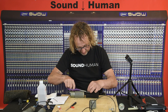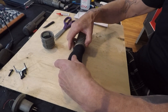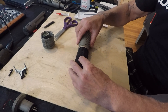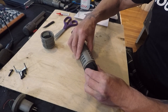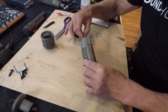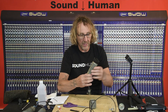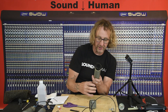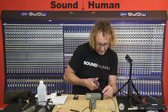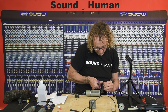We've added hot glue beads around the outside of that perimeter, making sure the tubes are shooting to the sides where the air vents are. We slide the capsule in, making sure the wires aren't getting mashed. It looks good — the foam is up here, we can see through, and we've got really good placement. The foam is stretched out a little bit, so we trim off the excess up top and leave a little excess on the end. It's supposed to extend a little beyond the diaphragm. This looks great.